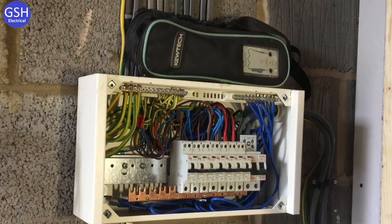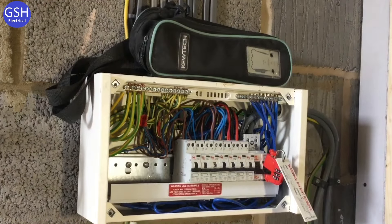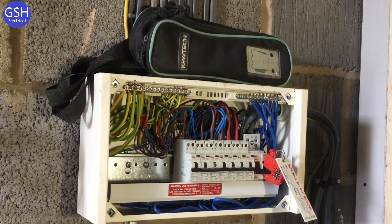We're happy the bottom of the switch has isolated the consumer unit. We now secure the isolation with a padlock and sign, and replace the plastic bar over the busbar. According to BS7671, the first live test we're going to carry out is supply polarity — we'll do that at the top of the double pole switch.